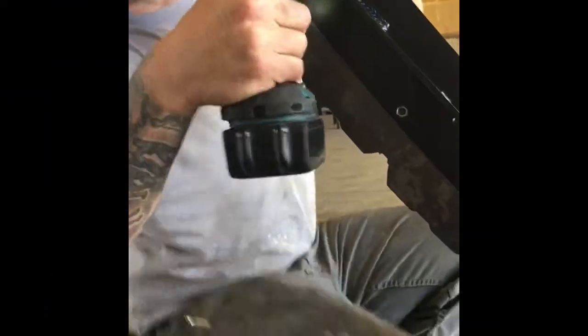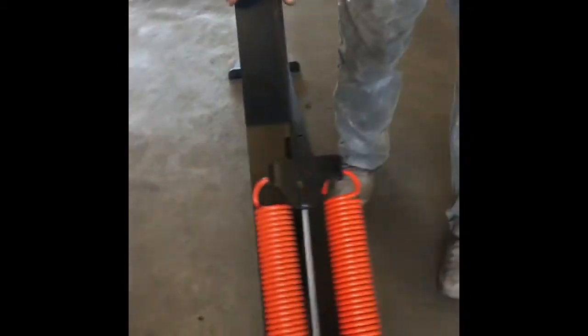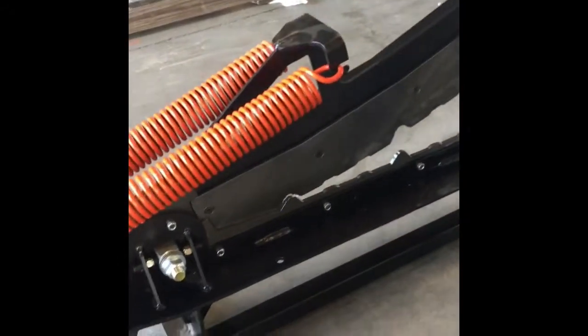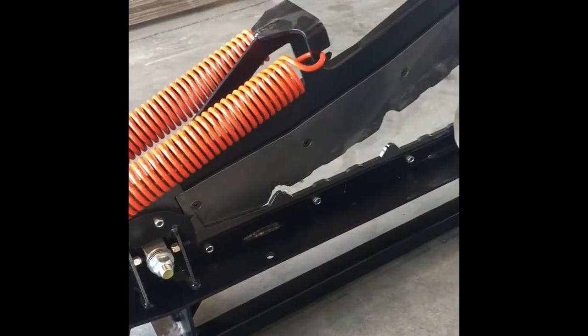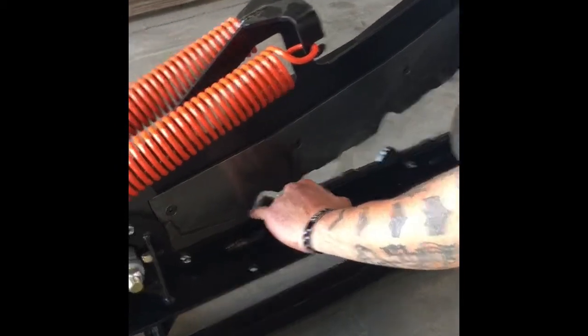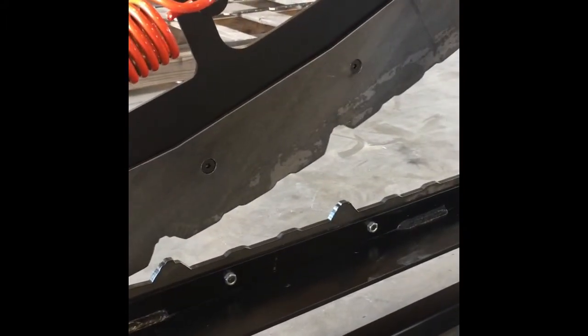Work your way up to the top. Now when switching out your blade sets, after you have them all tightened up, slowly come down and check your alignment. There's another video showing how to align your blades. Look at the bottom corner and make sure those corners line up. If they are not lined up, watch the other video on how to adjust it — adjust it before you cycle it so your blades don't start getting damaged. Once they are lined up, put a little bit of pressure away from the blades and cycle them.